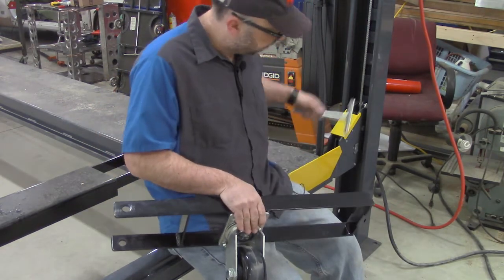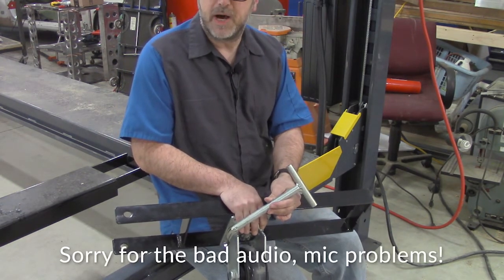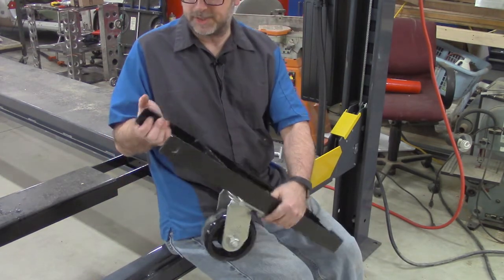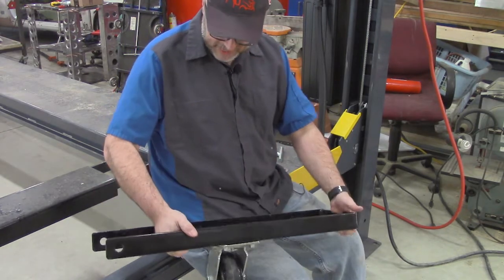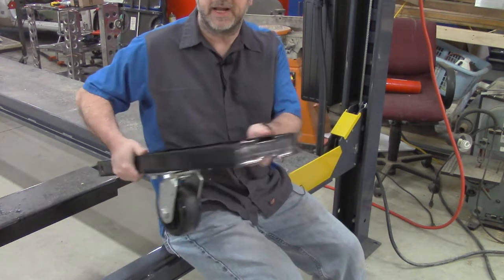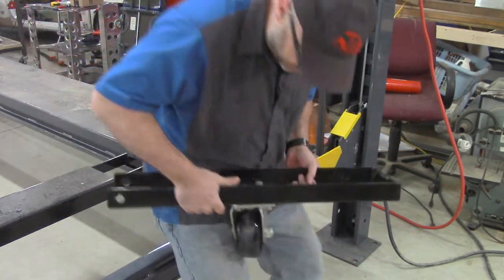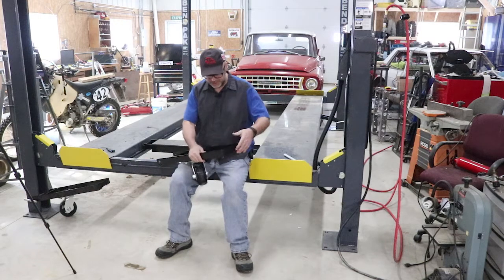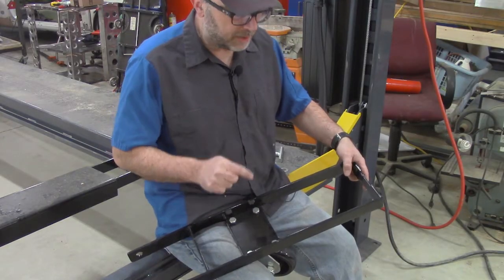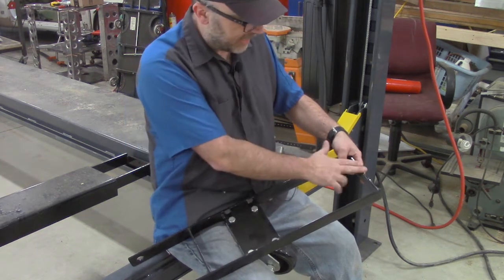There is a large pin that goes through some small holes that lines up with the two holes on this end of the framework. The caster wheel is not quite centered — it's slightly closer to one end. On the far end there is a notch so that it actually fits into the cross rails when it pushes down, keeping it from sliding side to side. If you're not careful when you lower the lift down onto this, it can get a little twisted and won't be in that groove, so that's something to watch for.